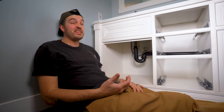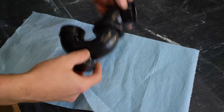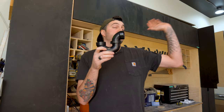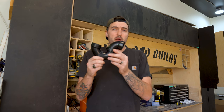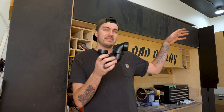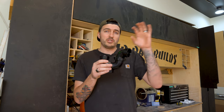More than likely, the issue with the slow draining sink lies within the P-trap right below it. This right here in my hand is known as a P-trap, and you'll find one of these under every sink, bath, and shower in your home. They serve a few different purposes — the main one is that the lower section collects water, which stops horrible smelling gases from the sewer coming into your bathroom, which is very important. It also helps collect debris.